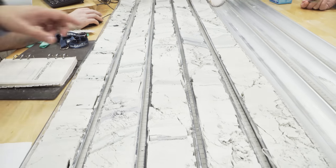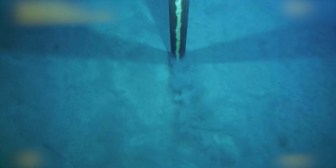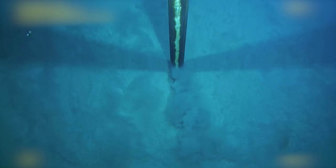And then there's the old-fashioned way called rotary coring, which most people try to avoid — it takes the big bit and just drills right into the material and goes down. The problem with rotary coring is you can't use the same pipe. So if you start drilling with one of those sets of methods and you suddenly switch over, you've got to pull the entire pipe back up to the surface, rebuild it, and put it all the way back down.